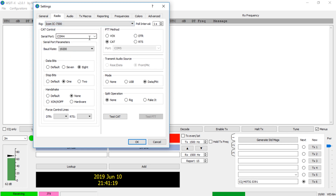In this particular case it works best with the IC7300. When you've installed the USB drivers from the Icom website for the 9700, you're going to get two extra COM ports - something like COM4 and COM5, or they could be higher numbers. What we're interested in is the lower one of the two new ports. In my case it's COM4.